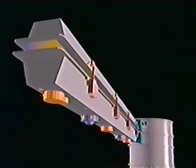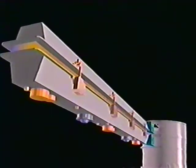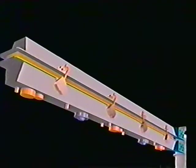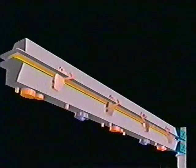The unlatching of one blanket box can now begin. During unlatching, the post-deployment tension mechanism is actuated and reduces the tension of the blanket tension distribution system. Simultaneously, the blanket restraint pins used to restrain the blanket during launch are released. Each pin provides visual indication of retraction by projecting a small tube out of the bottom of the box. Electrical confirmation of successful pin retraction and full unlatching is provided by limit switches. The second box is unlatched in the same manner.